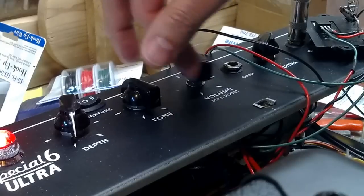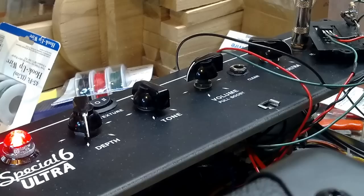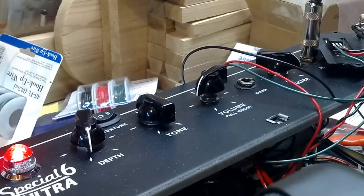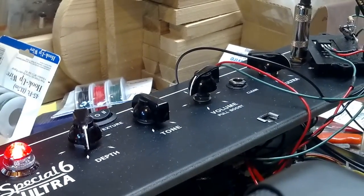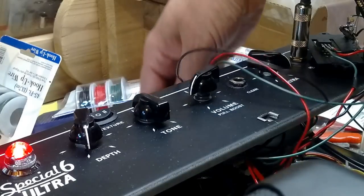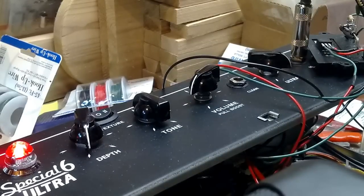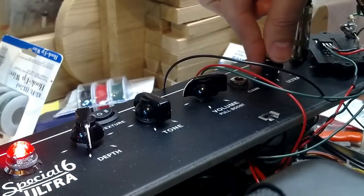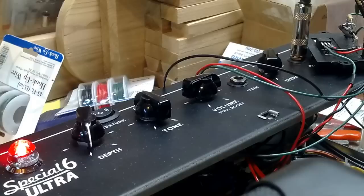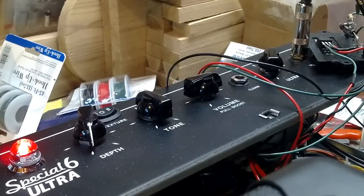The volume is now a master volume, and the input is now basically a dual input. With maximum signal, clamping it down is really important for the reverb. I've got the reverb pot way back here — I haven't really wired it in yet. With no reverb you can kind of hear it, but with the distortion there's not a lot of benefit. Let me clean it up. Now you hear a lot of reverb if I max it all the way. I've got a 100k pot there and then a series 33k to the output.